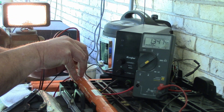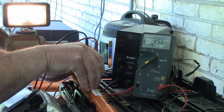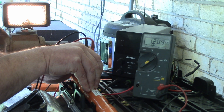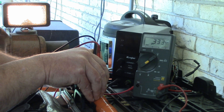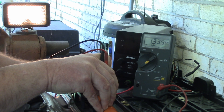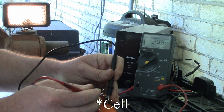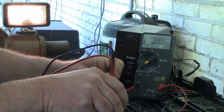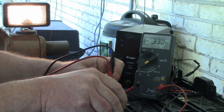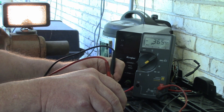So this one — 1.3 volts, looking good. This one — 1.3 volts, looking good. This one — 1.2 volts and dropping rapidly. That one is the third one I talked about that might be a problem. Now this one — look at this — this one is almost depleted. It's down to 0.3 volts. This one, 1.3 volts, is looking good. So from this view we can already tell that maybe we have one more bad battery. Let's try this last cell. Uh oh, look at that — it's negative. It's doing that reverse polarity charging because it's so weak that discharging this stick is causing current to flow through it backwards. And you can see the numbers increasing — it is increasing its negative charge right now.